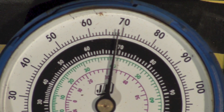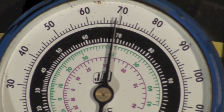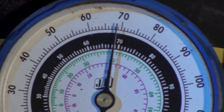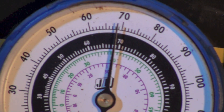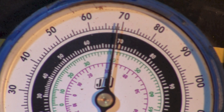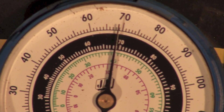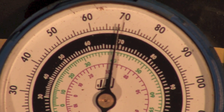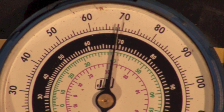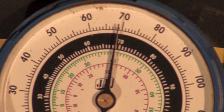I'm running just under 69 pounds. If you look at the green scale — that's our R-22 — we follow that up and we're right at 40 degrees. That's the evaporating temperature. These gauges are a little harder to be accurate on because the gradations are pretty close together, but we're sitting right at 40, so we have a 40 degree evaporating temperature.